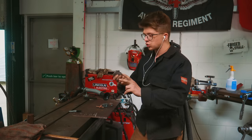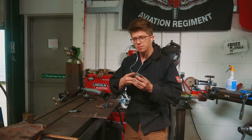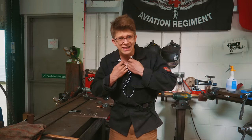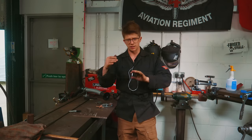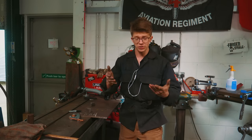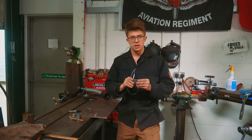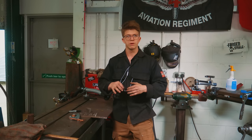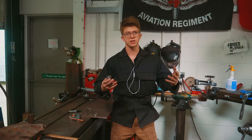So now I've got six pieces — two of which are 1095 steel and two of which are titanium. We need to get these ready to go in the fire. The thing is titanium is going to oxidize when it heats up and it won't stick. From my understanding of how people make titanium Damascus — stacking different types of titanium — they are always very concerned about oxygen getting in between the welding surfaces. I presume I should be too. So we're going to scotch-brite these surfaces clean, clamp them up nice and tight, and then I'm going to fusion-TIG weld between the titanium, the steel, and the other titanium — puddle all over it so it's sealed up — then go into the forge and heat them up to see at which temperatures it likes to stick.